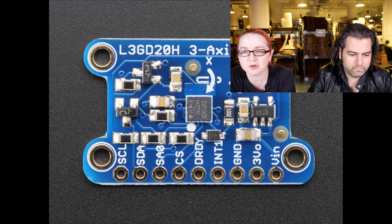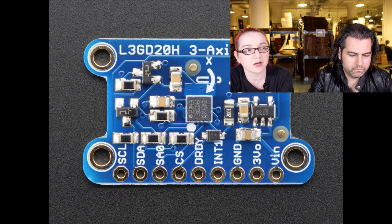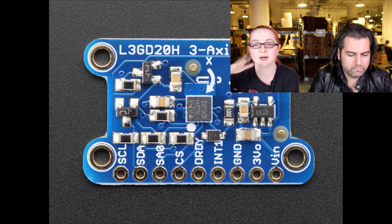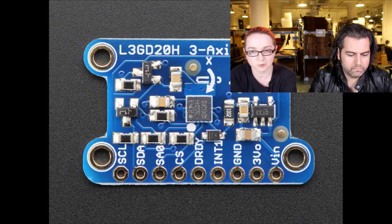And in general, unless you check the ID register, all your code will be exactly compatible. This one has a little bit lower power consumption. It has much better noise immunity for the nano. Oh, I can't remember the unit of the noise, but the root hertz noise for the gyros is much lower, so you should get less drift and sort of random walk behavior with your gyro.